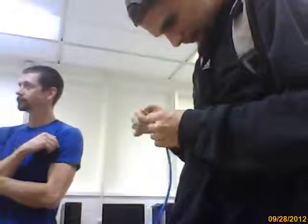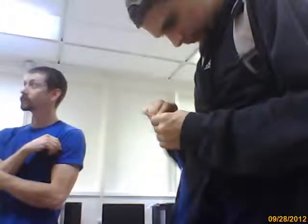Not joking. So if we take one of those drop downs over there, plug it in, go to the server, and put that address thing on the other end of it, will it tell us how far the cable runs up to there, counting the length of the cable going to the drop? A lot of times, within a few inches or even a foot, it'll tell you roughly how long. Yes, it would tell you, say there was 125 feet of cable going up, going across the ceiling and going to the MDF, the main distribution facility. It would tell you how many feet, plus counting the amount of patch cord.